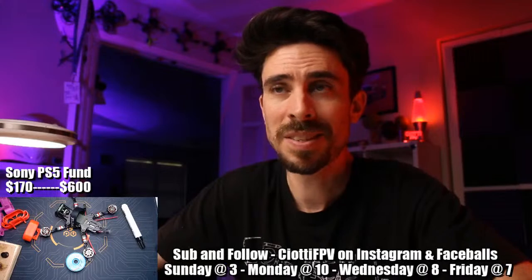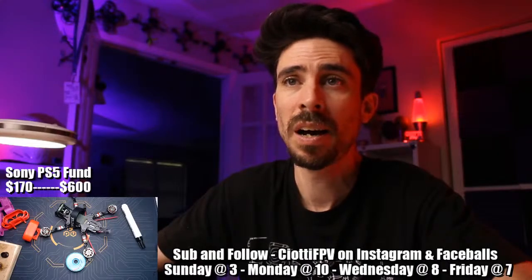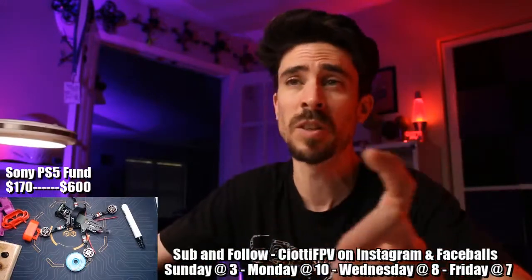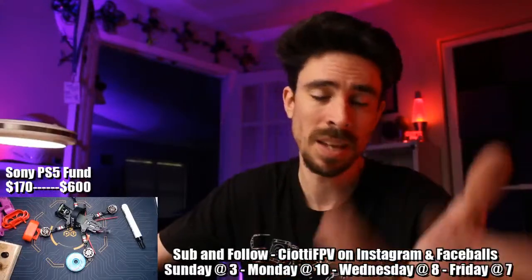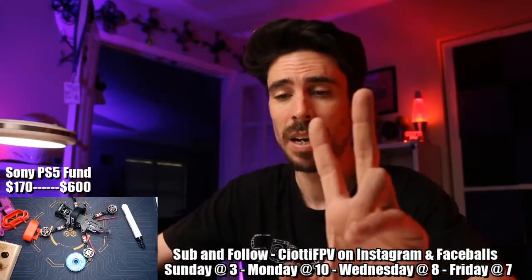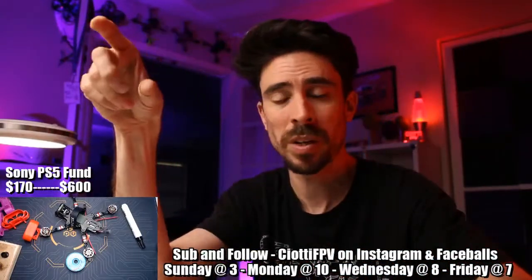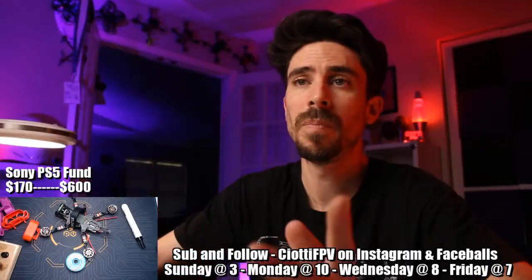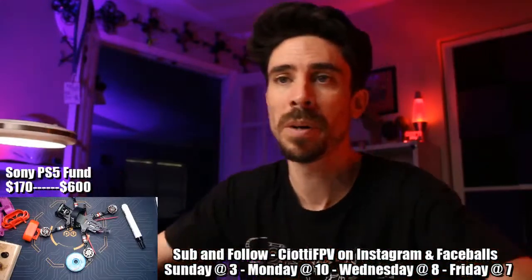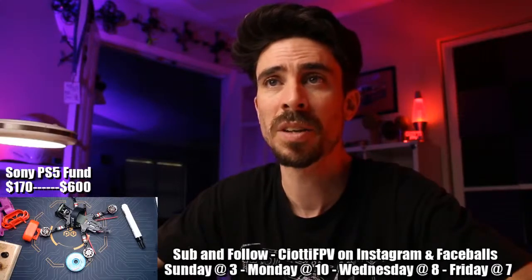John Goblin says, ExpressLRS 868 megahertz and 2.4 uses different software. You need to switch out every receiver and get a new module. Correct. Yeah, there is a physical hardware difference between 2.4 and 868 or 900. But usually, and I can't confirm this, with Crossfire, for example, 900 and 868, it's just a switch. It's just a thing that you click. I assume that ELRS is the same, right? Because those two frequencies are so close by, you should be able to just click a button. But don't quote me on that, because I have not looked into 900 megahertz ELRS stuff.